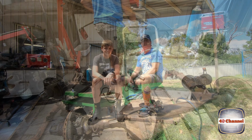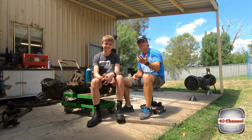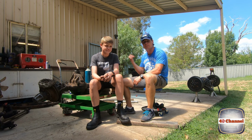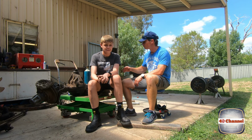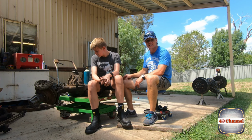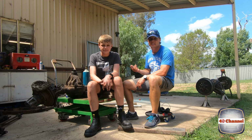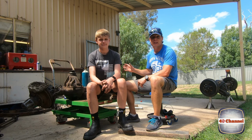Righto, that's it for another 40 channel episode. Thanks for watching. We've stripped off the chassis, repaired the chassis. It's at the sandblaster now, getting ready to be cleaned up and painted. Stripped the axles down, so we pulled all the springs, the hangers off it, damaged nuts and bolts, pulled all the brake lines off. So they're ready to be cleaned up and painted as well.